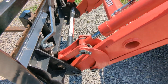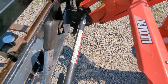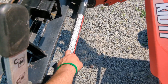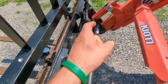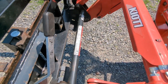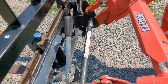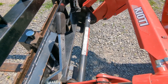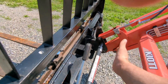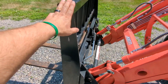Before I begin, like I said, it's measured at the pin. The pin is pretty much right in line with this bar. However, I don't know the wall thickness of that bar and I don't want to potentially damage or bend it, because the quick-attach frame is actually kind of a lot of money. So I'm never going to be able to get an accurate measurement for the lift capacity off the pin. What I am going to do before we get started is weigh the forks.